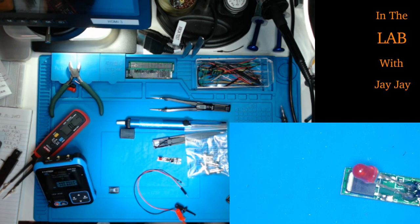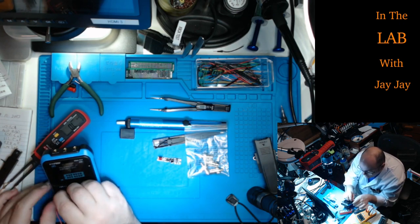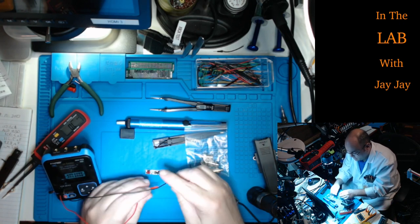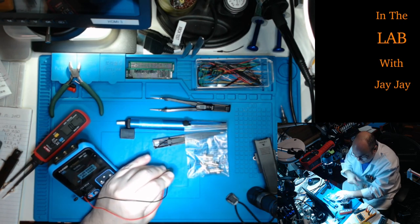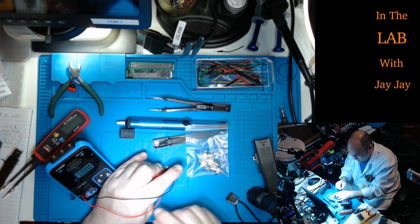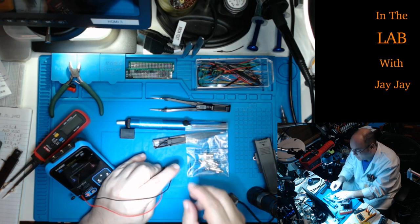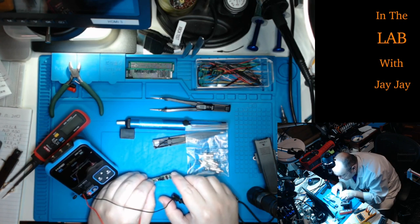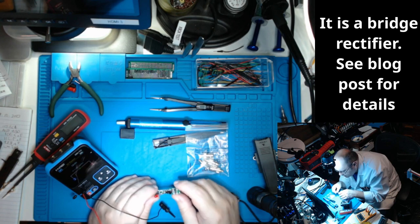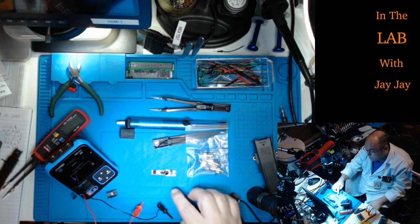Let's pop the probes back in - one and three - lock them in place. Let's hold these in place and go test. It says unknown or damaged part... diode! There we go. So that's 0.68 volts, 0.4 microamps. So we got that. The first one's a resistor, the second one's a diode, and that other thing - DR1 - is probably a bridge rectifier. I'm not sure what all the bits are underneath or what that top bit is.